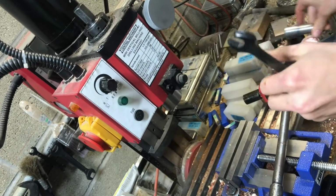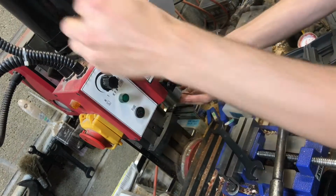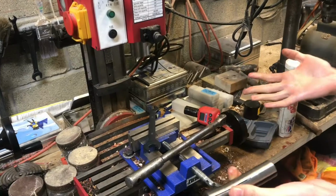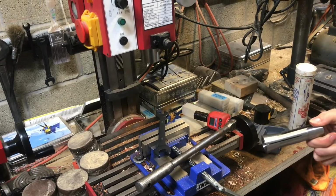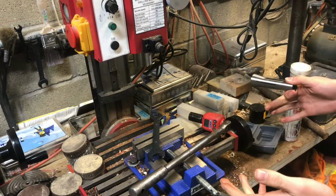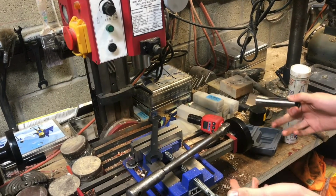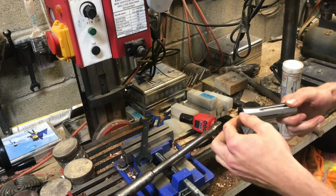So in case you didn't know before, you want to keep your collets dry or degreased. In conclusion, if you are having slippage problems with your collets, you can use this method to experiment and determine if what you're doing is helping or hurting your slipping force.